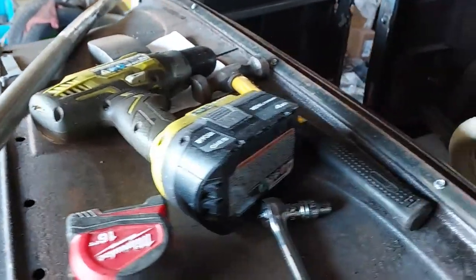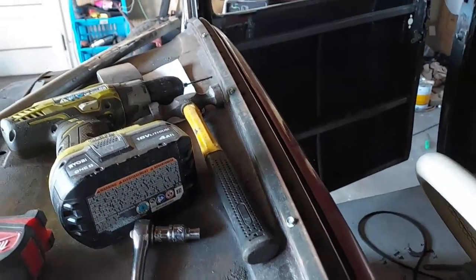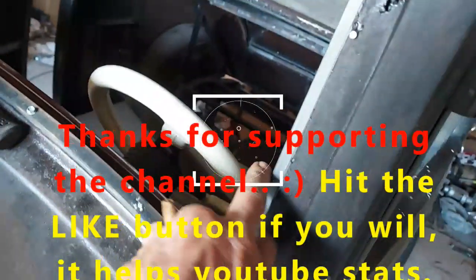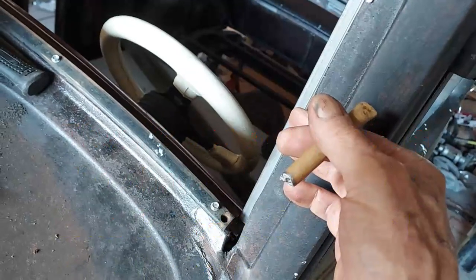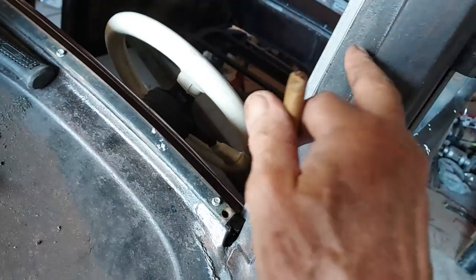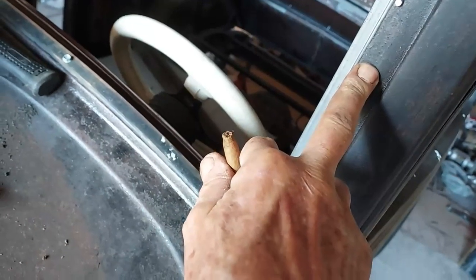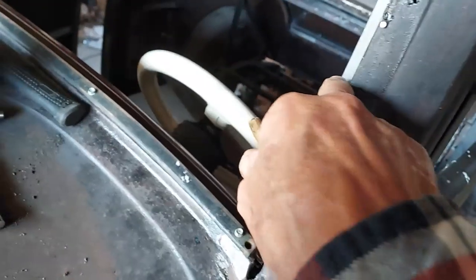And then on the back, once it's welded together, of course I can't get the glass in it. So what I'm going to do is weld a plate on the back of this. This angle iron is flush with the back of the 1 inch piece. I'm going to put a plate on it, and drill that plate and tap it so it'll bolt into the frame. And then once that's done, I'll take it out and I'll cut the plate and the angle iron in half.